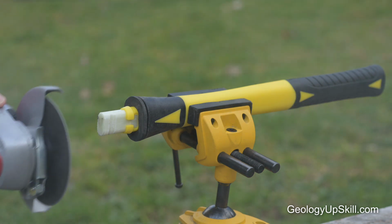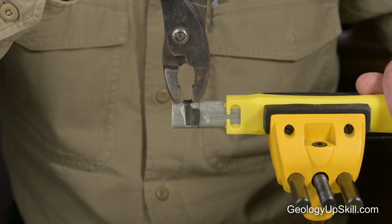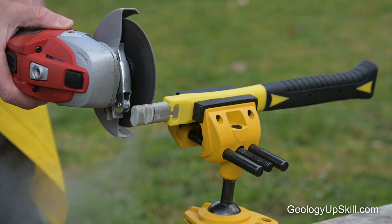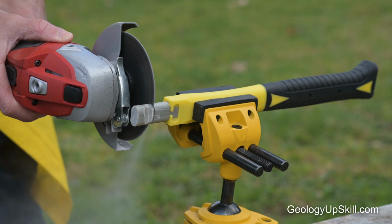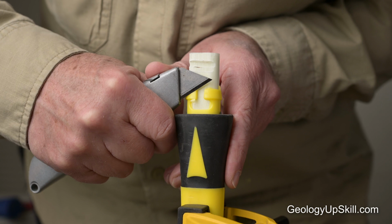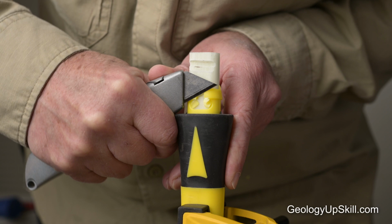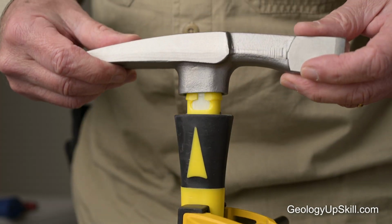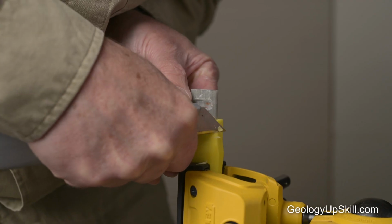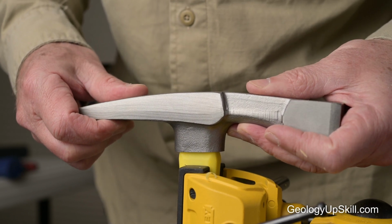I had to cut about 10 millimeters off the shaft of the engineer's handle so the end would sit just below the top of the head. The claw hammer handle was also a bit too long, but it needed a bit more work because the centering clip would have extended above the head. So I cut it down and ground another groove for the clip. The plastic barb on the engineer's handle was also a little too thick for the eye of the head, so I trimmed it with a knife until I got a perfect fit. The plastic shroud on the claw hammer handle is designed for a rectangular eye, so I had to trim that a little as well to make a neat fit.